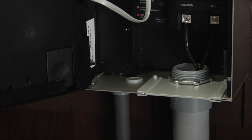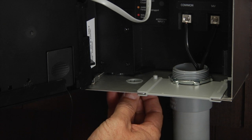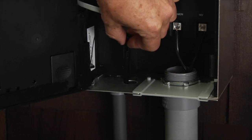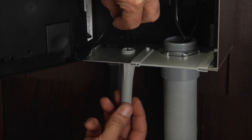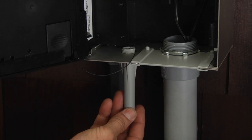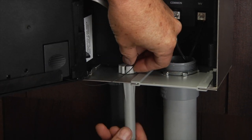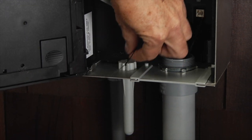The Wi-Fi antenna connects to the bottom of the Luxor through the half-inch hole. Remove the plastic cover over the half-inch opening, and insert the antenna down through and into the plastic antenna case. Bring the case up inside the main box and take the screw top for the antenna case, slip it over the antenna cable, and attach it to the antenna protector, being very careful not to pinch or crimp the antenna cable.